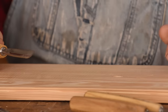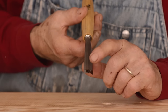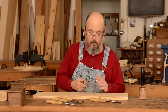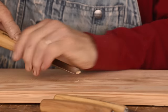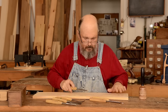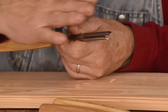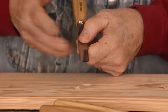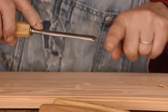The other thing is these bevels on these gouges — you can see this is a fairly long bevel — they're often slightly curved. They're not like a mortise chisel bevel or a bench chisel bevel that are flat and straight. These have a slight curve to them so that you can come into the work and immediately come out of the work. So often in carving you're working in short areas and want to come in and come out. The bevel is not necessarily ground straight across; it's ground with a slight curve. On the other hand, the chisels are ground straight across the other way — they're not curved in that direction at all; they're straight across, so they do have two sharp corners. But curved just slightly along the bevel length.